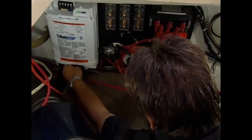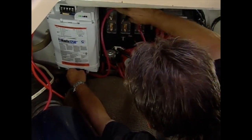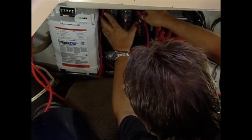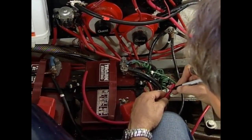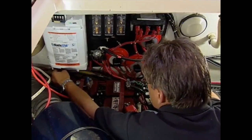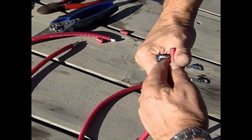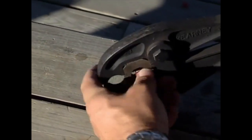With the charger in place, I measured and cut the lengths of battery cable required to connect the charger outputs to the fuse holders. Since the charger is capable of outputting its full 50 amps to one bank, based on the distance from the furthest battery bank, the installation instructions called for AWG6 cable to handle the load. Next, the process was repeated for the battery cables required to connect the fuse block to the three battery banks. The last step in preparing the 12-volt connections was to strip each cable end and crimp on 10 marine-grade ring terminals using a serious crimping tool.